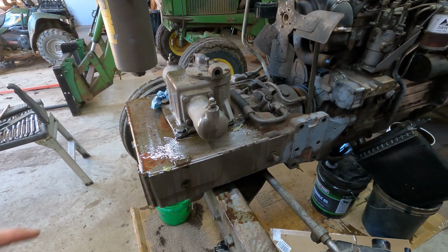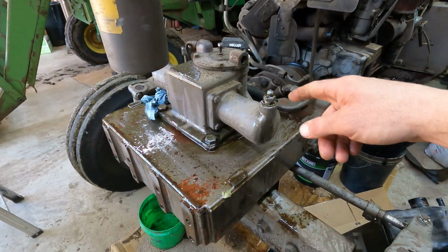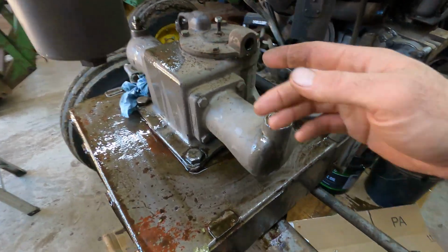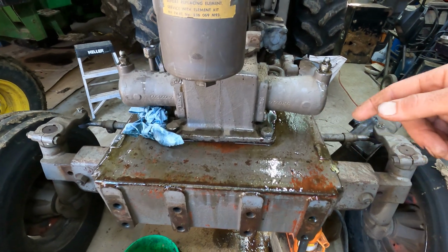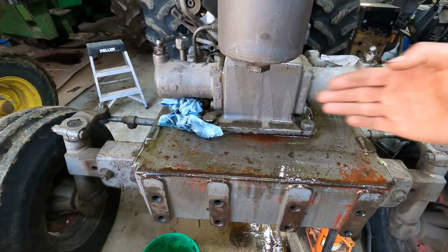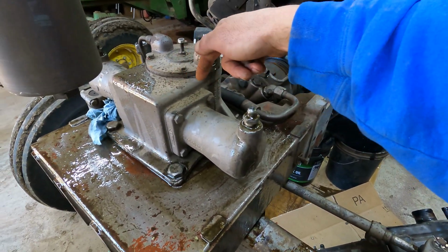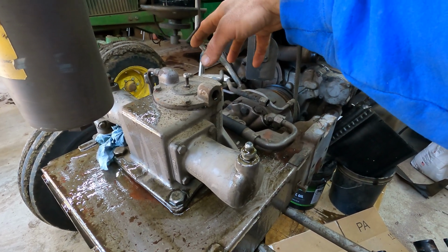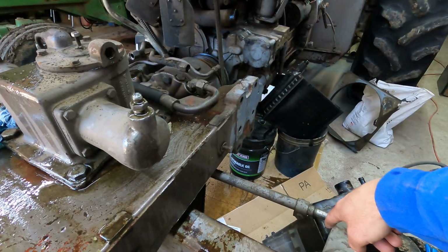But anyway, this is the steering rack right here. The way this thing works is on the back side of it, there's a cylinder that goes back and forth across here from side to side, and depending on how you turn your steering wheel, it's all hydraulic. So the hydraulic fluid comes in and pushes it this way, and as it pushes it that way, there are teeth on the back side of this rack. Those teeth turn a basically a sprocket or a gear, and it turns one way or the other, and that's what turns your tie rods down here.